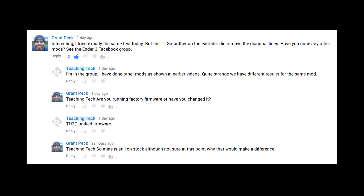Immediately after releasing the video I had commenters telling me that I should have tested on axes X and Y. I must commend them for how polite and constructive they were — normally YouTube comments are just not that nice, so I really appreciate it. Several people commented that Nexitec, when he tested the Ender 3, added TL smoothers to X and Y and had great results. Another gentleman by the name of Grant Peck posted that he had added a single TL smoother to the extruder, it got rid of the banding, and his results were completely different to mine.